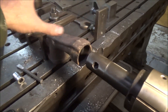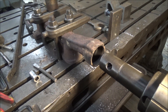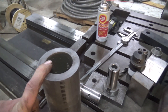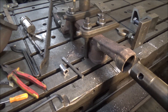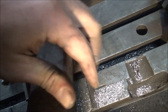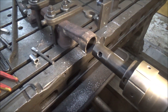Of course there's nothing machined to indicate off of here, so I'm just going to do the hunt-and-peck slow-advance method to find the natural center. I'll get it cut out to something true and cut a piece of tube to put in there, then come back and bore it to fit while this is all still set up. I got the bolt holes lined up on my 90-degree slot in the mill table, so that's my reference — this will be true. Let me get cutting.